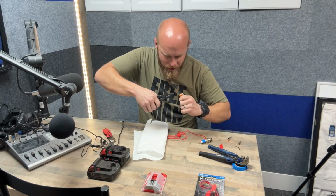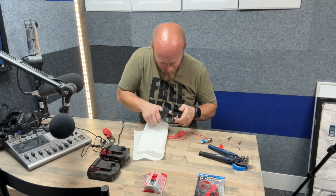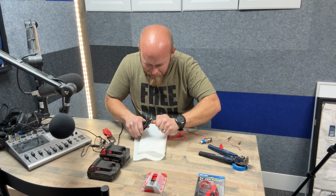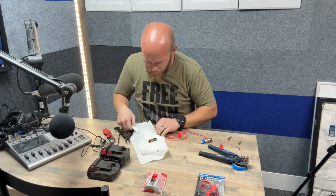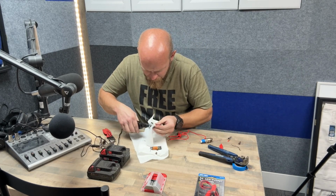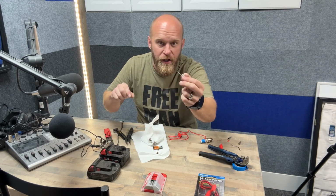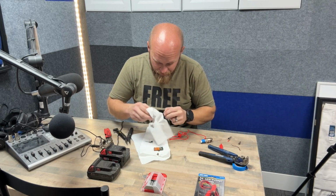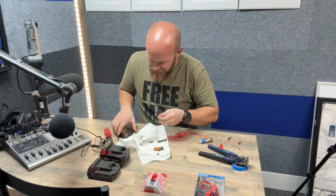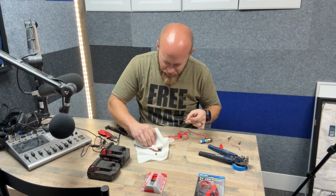So this is where some needle nose pliers will help. Kind of just have to peel this top off to get down inside of it. We want to be careful because obviously there's going to be acid and oils, so I'm going to keep that off my hand. I'm just going to peel that back. Now what we're looking for in here is this rod that is inside of the battery. So we're going to clean that rod off, and then we're actually just going to chop it here. Then all this gunky crap we can just get out of the way.